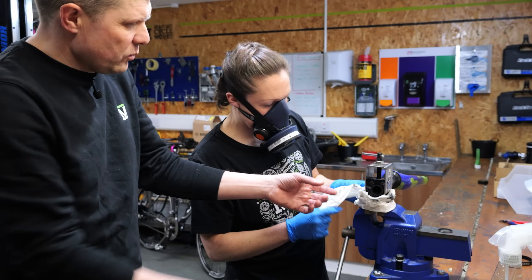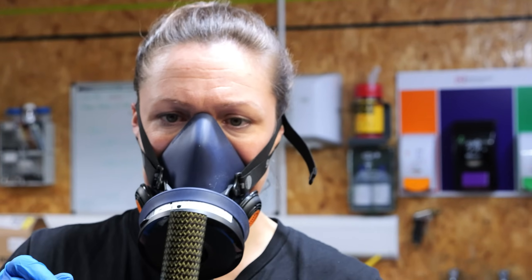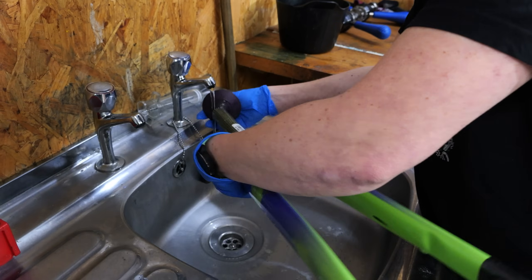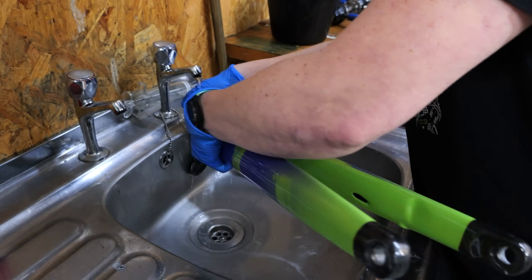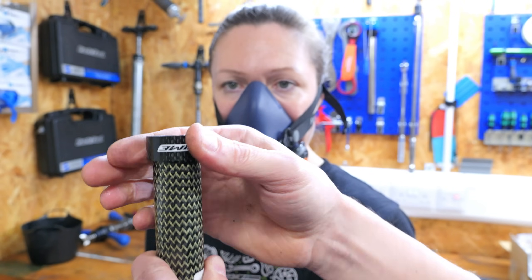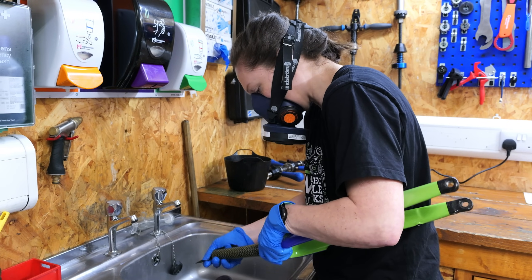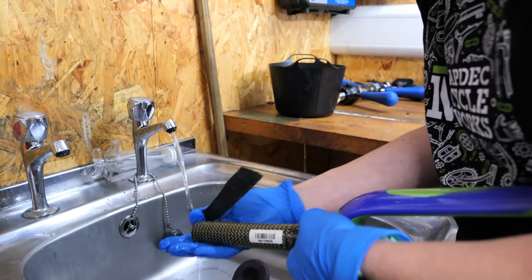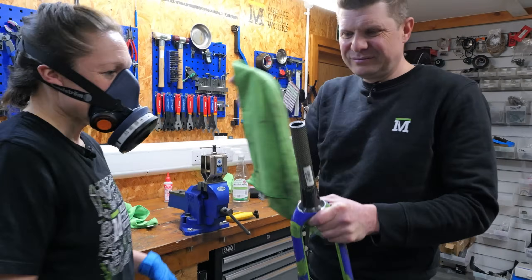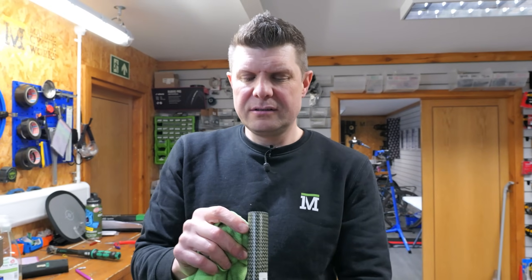Now it's all dusty - gather it all up with the white cloth, wipe it with your gloves on, and get rid of all that carbon waste. Just a little bit of tidying up to do. We've got a fun little tool - use it wet. This one does the outside, this one does the inside, and we're going to put a small chamfer on that just to tidy it up. Then use the sandpaper wet, sanding in one direction only - that way you take off the fraying of the carbon edges into a nice chamfer. Good job.